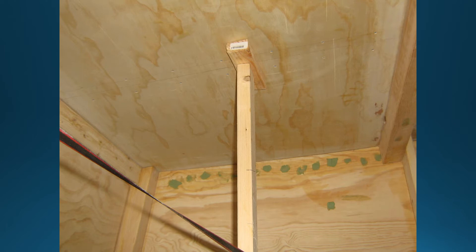Use a block on both ends to protect your floor and boat. Once the gap was removed or nearly removed, I used 2 inch screws 6 inches on center in 2 rows. You can see one row here. This is the center line, so spaced on either side of the center line I have a screw — they are 6 inches apart. They are 2 inch screws through the 3 quarter inch plywood and into that inch and a half thick keel. I used 3 inch long screws common to the keel and the frames or the bottom timbers. After the epoxy cured I came in and installed additional screws between these, so that we end up with 3 inches on center, like most everything else in this boat build.